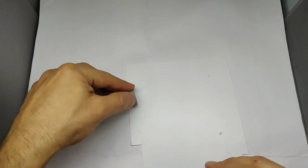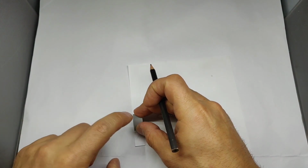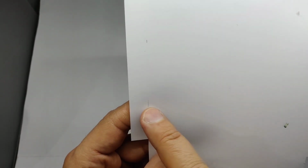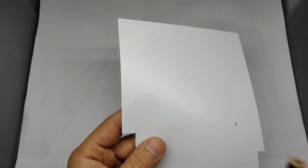Very easy. I have already drawn the perfect line. However, let's do another one once again. We take the rim, put it on an edge, alright, leave it a little bit loose from the back, and on the front with the pencil just draw a line, and that line will automatically be a little bit further out from the rim. So it's important that this width is actually a little wider than the rim, so that in the end, once it is fully attached in place, you can sand it down lightly from the back and the front to make it the best fit possible.